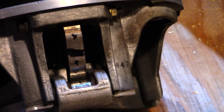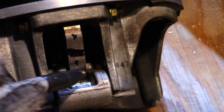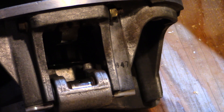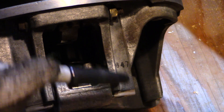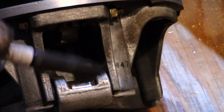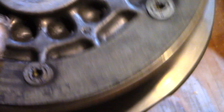You can replace the weight on this just fine — the weight's easy to replace. But it's this roller in here that is part of the spider, and Cat doesn't make a rebuild kit to rebuild the spider on this model. They do on older models, but not on this one. So we'll keep this one for parts, but we're going to double check the part numbers on the weights and make sure they match our new clutch, because we want everything to be calibrated properly.